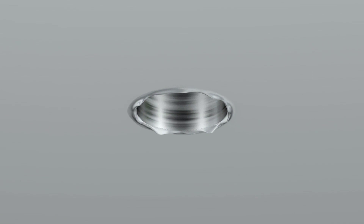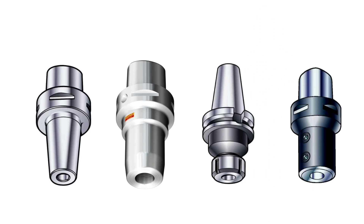So what can we do to minimize it? A first tip to reduce runout on an existing application is to regularly disassemble the drill and tool holder assembly and check that all parts are clean and not worn out. Always select the shortest possible overhang of the tool assembly to secure stability. The right choice in tool holding is also critical in limiting runout.